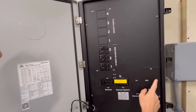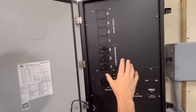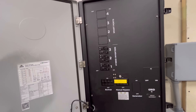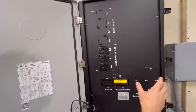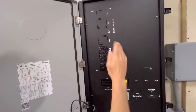EG4 provides the specs on the 200-amp Eaton switch you'll need. If you think about the electricity in the Grid Boss flowing like water, then the relays are going to be dams that open and close to allow the water through. After your power comes in through the meter through this 200-amp switch, the modes you use are going to determine how the electricity flows — even to the smart ports, which have their own relays.